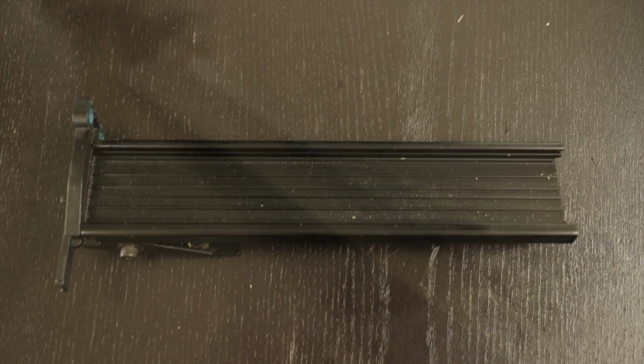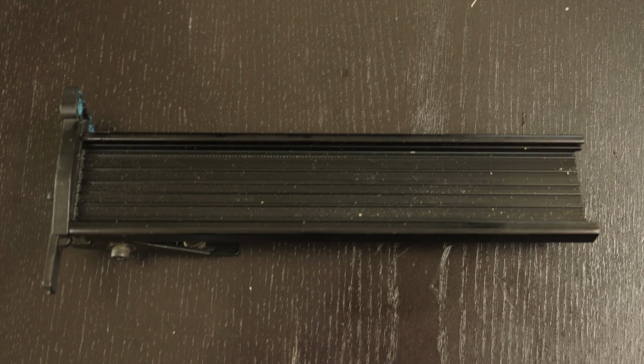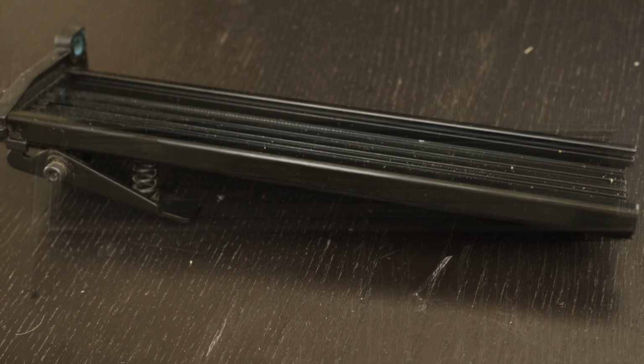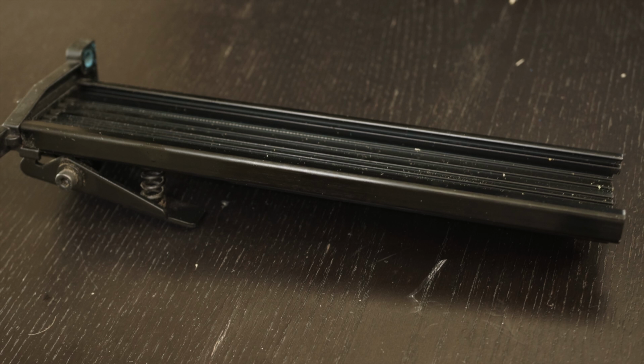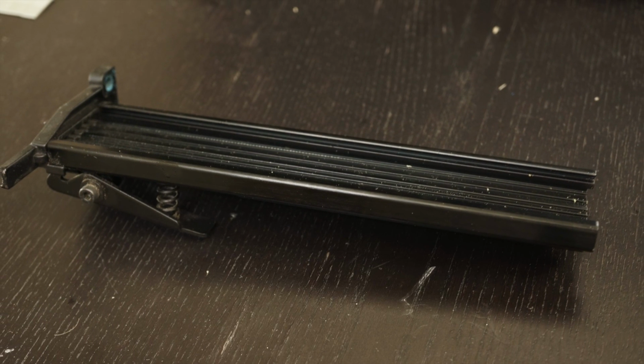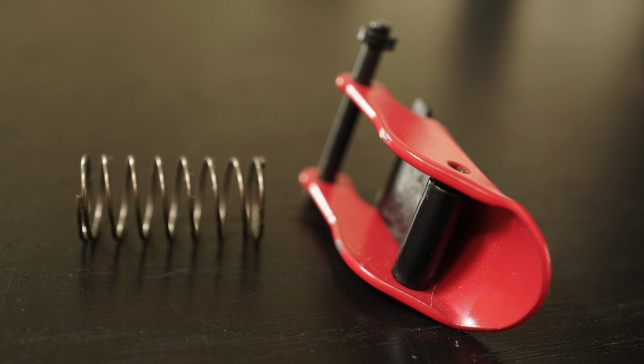The spring-loaded slider rail is responsible for loading the following nail after one has been ejected. Judging by its geometry and being made from aluminum, it is likely produced by extrusion. Extrusion is an excellent process for mass production because of its high yield and relatively low cost in making completed parts. Extrusion usually produces parts with acceptable surface finish and therefore no post-machining is required.